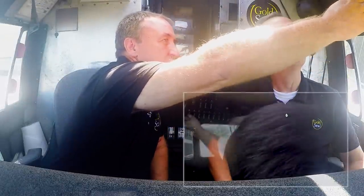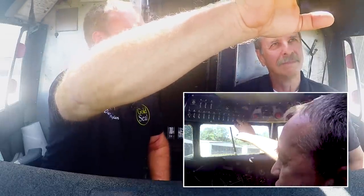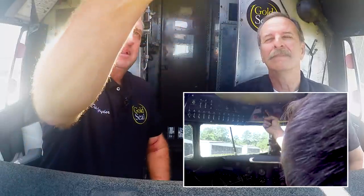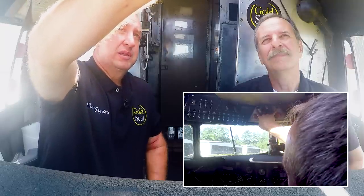Let's go through just the switch layouts. Every DC-3 is laid out completely different — they built 14,000 of these things, so you'll find every which kind of thing under the sun. But they've all got a few things in common. Here's a switch that controls whether you're on ship's power or auxiliary power. Here's avionics. The rest of these switches are lights — lighting control for inside and outside. Seat belt light, landing lights, strobe lights. In the center panel: ignition master, which kills all power to both magnetos — that's something you don't typically have on your single-engine airplanes.